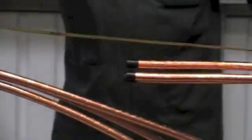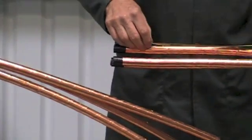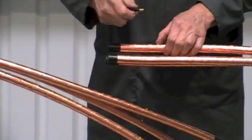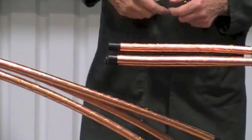Now the joint has a long side and a short side. The long side is for parking the connector insulation tubes onto the cores. So we're now marking out the short side.